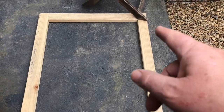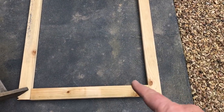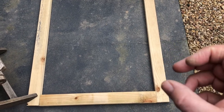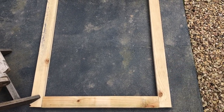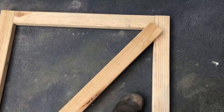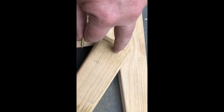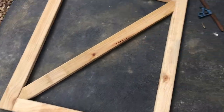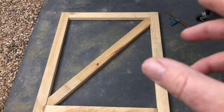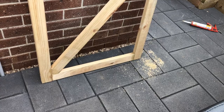If your length by width is equal then it'll be exactly 45 degrees — the angles you cut. Mine's not; it's taller than it is wide, so the angles will be a little bit different, so I'm just going to lay the board down where I want it to be and draw the lines on where I want to cut it. Now these cuts are going to be super accurate, because if you cut it a bit too small the stay is not going to sit in the corner, and if at all possible you do want your stay to go in the corner. Just scribe the lines where it's going to be cut. You want the saw blade to be on the other side of the line, taking that away so that all of this is left. That's cut with all those angles, and that's now ready to glue and screw into here. There we go — put the stay in and you've got yourself something that's looking like a gate.